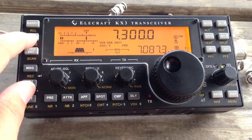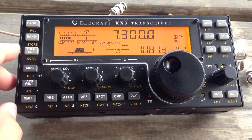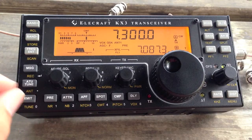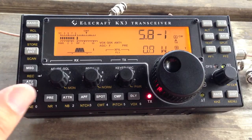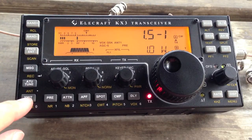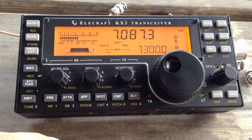Let's go down to 40. Like I mentioned before, due to the extremely small size of this core there is a very high Q, so the tuning range is very short. On the voice portion of 40 we're too high, but in the CW section, not too shabby. So surprise, surprise — the thing actually works. All you naysayers, stop saying nay.